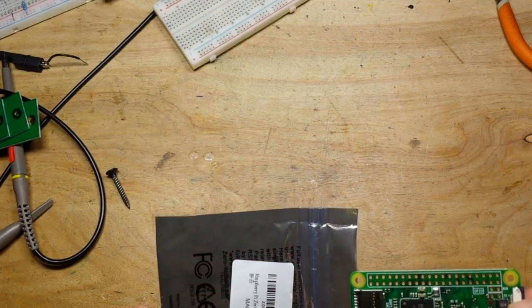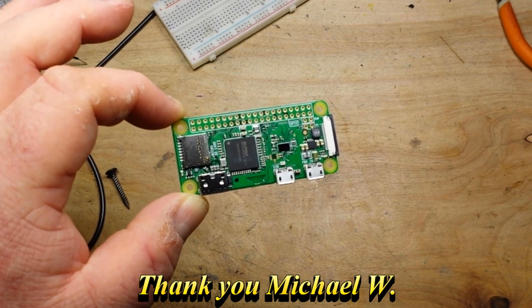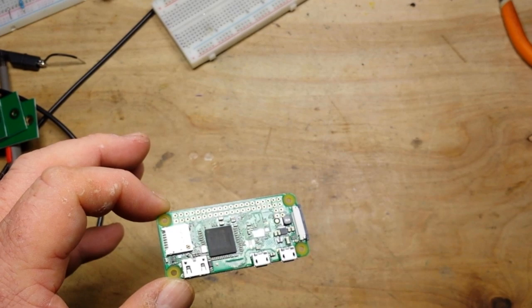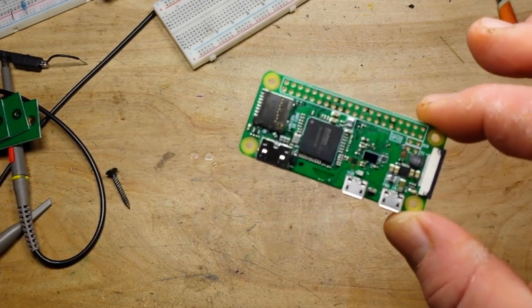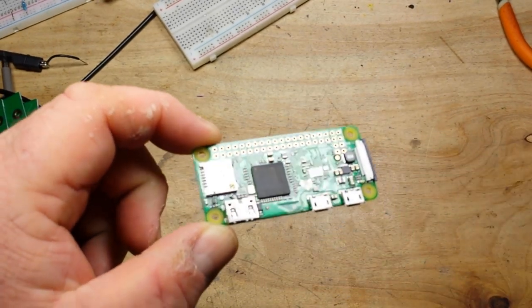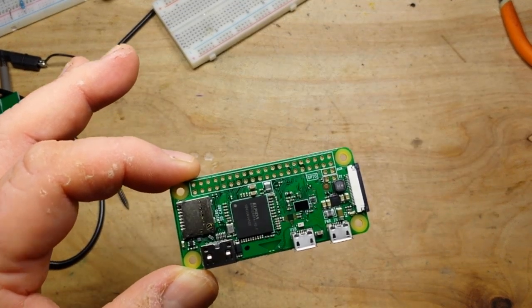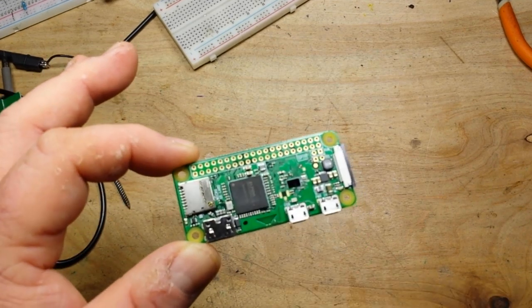It is a combination electronics ham radio project. What I got here is a Pi 0W. You guys are all familiar with these little guys. They're great. Now, if you've done any ham radio stuff at all, I'm sure you've heard of WSJT-X, the Joe Taylor digital creation, and the WSPR mode, which is used for propagation testing. Well, instead of tying up your radio, you can use a piece of software called WSPRPI to turn this into a 100 milliwatt transmitter to do WSPR. But there's a caveat. This is only going to output a square wave, which is going to have some unwanted spurious transmissions. So if we make a low pass filter board to go on top of this, put an SMA connector at the end, boom, we got a nice sine wave coming out, and we'll have a nice smooth compliant signal. All we have to do is tap into pins 7 and 9 here, and we'll be good to go.